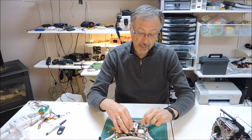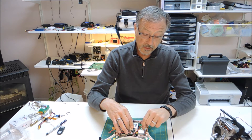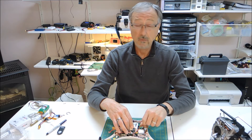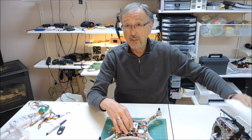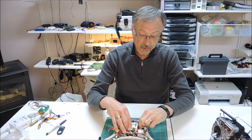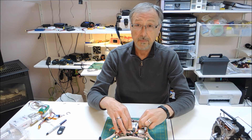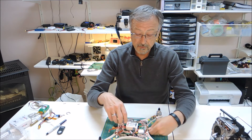He had jumped pins one and two and then put his servo connector on the third. This is a capture of the Hobby King video dealing with this installation and showing their jumpers line. That didn't work. Basically, as the instructions here indicate — at least for my quad — it's jumping pins two and three with the servo wire on pin one, and that provides the signal to the receiver.